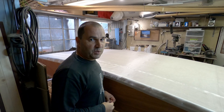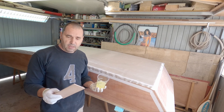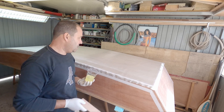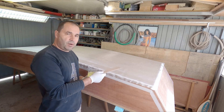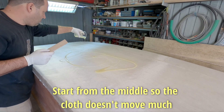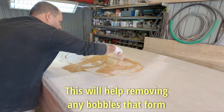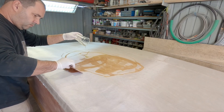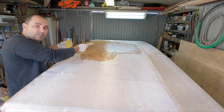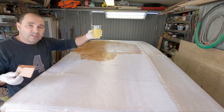We'll keep going tomorrow. Okay guys, ready to spread the first batch of epoxy. I've made a slightly larger squeegee because mine are way too small. That's 200 grams of epoxy and that's 80-gram cloth. I spread 200 grams of epoxy there and for some reason the camera shut down so I've got no footage, but here goes another 400.